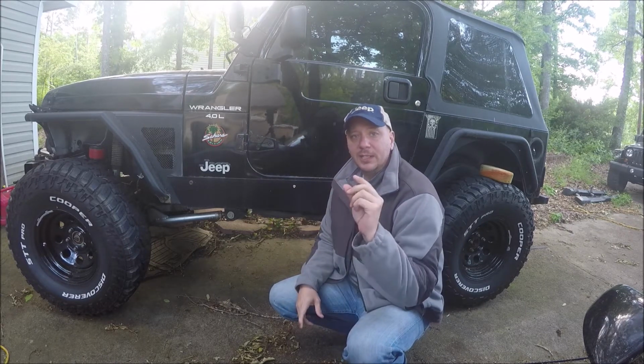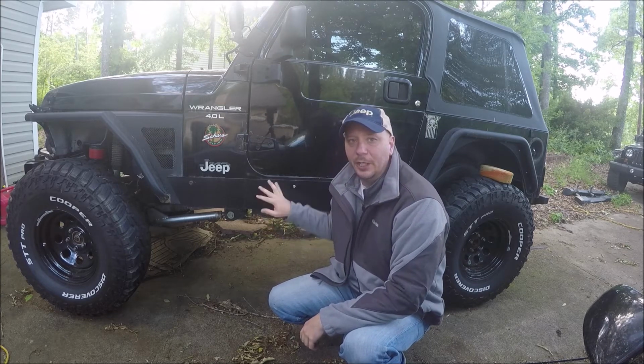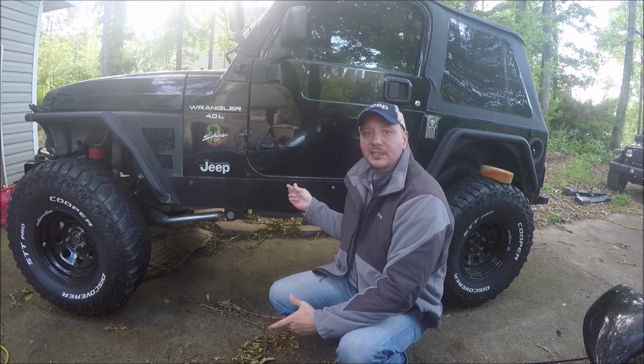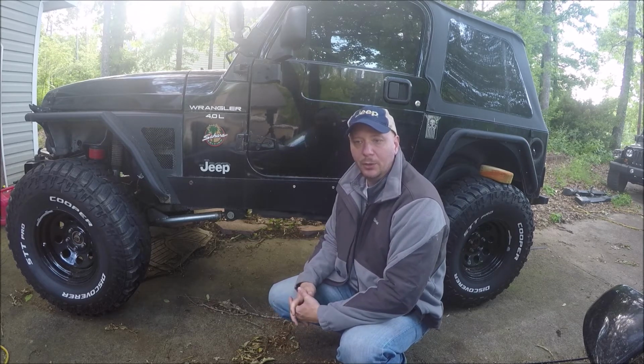A few tips as you're going through the video to think about. I originally used Plasti Dip. Don't do that. Just go ahead and primer and paint. And then I originally used just some black Allen headed bolts. Go ahead and use stainless. That keeps them from rusting. I did have a little bit of rust on the bolt head himself.